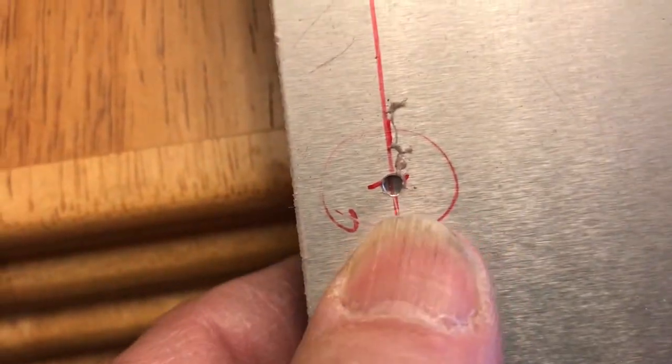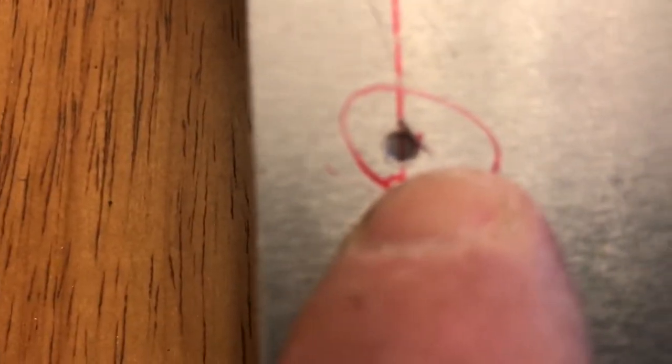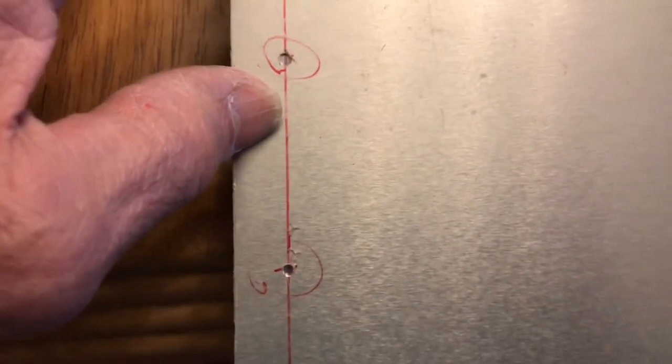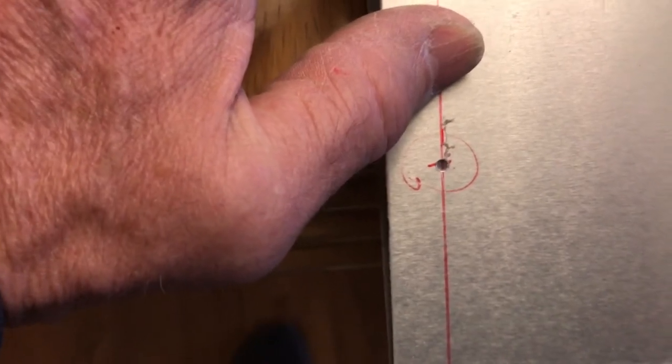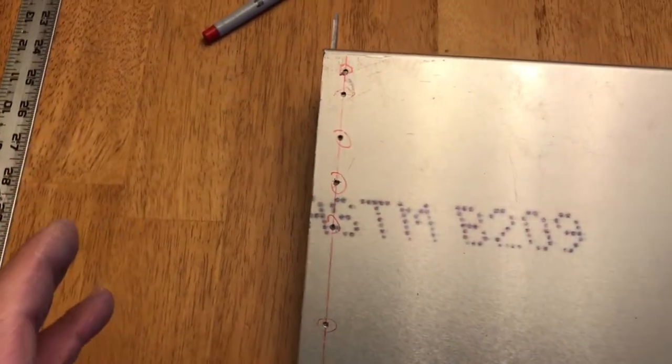You should see the line lined up in each hole. You can barely see it on camera, but you can see the line there in the next hole up as well. So once it's lined up, I simply press down on the skin very hard to hold it in place, drill the hole through, put a cleco in, and do the ones on the end first — one here and one all the way down at the other end — then work my way in from there, lining up as best I can.